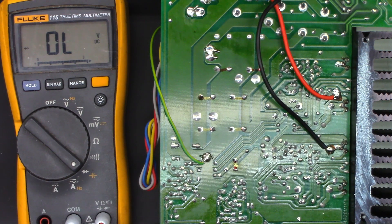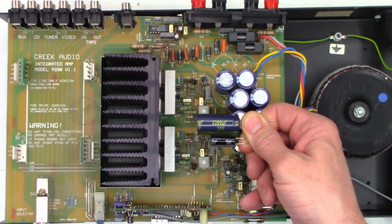I have not looked up a schematic on this — not even sure if I could find one. But I'm going to go ahead and do a preliminary quote to my customer and see if he's willing to put seven filter capacitors in this thing, which I'll probably have to order. It's kind of a specialized capacitor, but as usual I'm going to go with a much higher quality capacitor — definitely 105 degrees Celsius, a good name brand cap like a Panasonic or a Nichicon. I'm not going to go with another cheap Samwa brand capacitor.